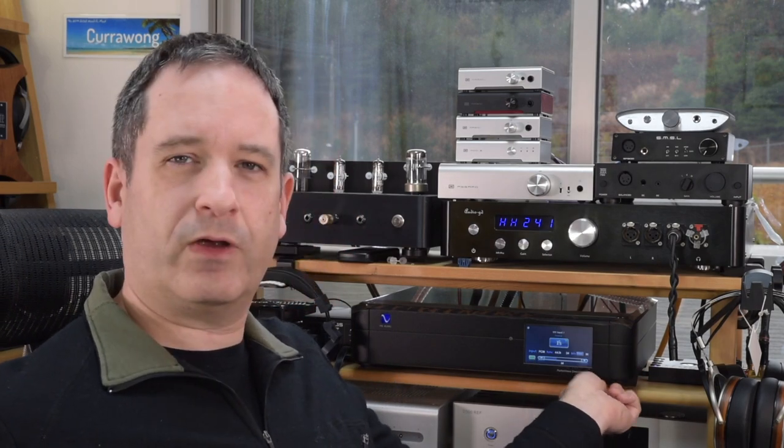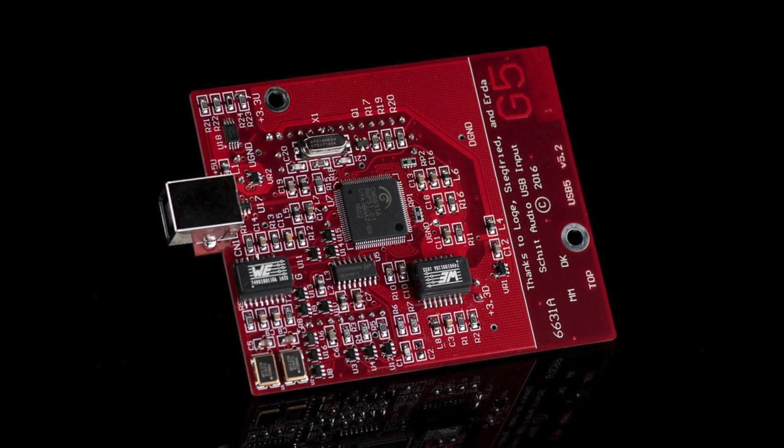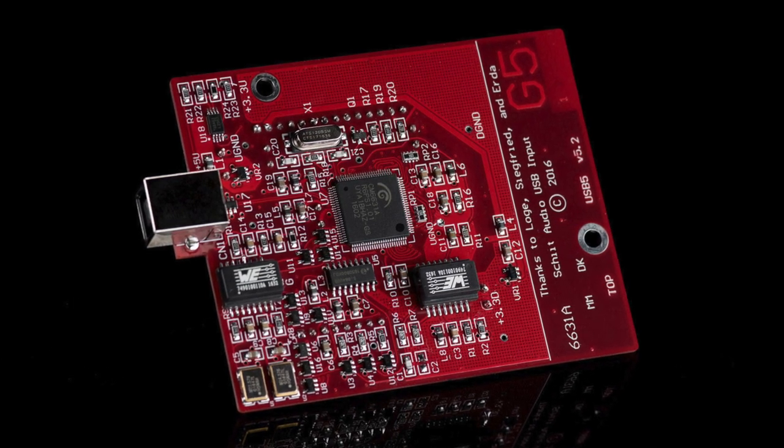I hooked it up using SoundAware's D300 Reference, primarily using I2S, but I did also try the USB. I didn't try the connections too much because of my impressions of the sound. This is a $3,000 upgrade over the USB input. Networking audio is a big thing these days — network connections themselves are isolated. We saw that Schiit Audio took the idea of isolation used in networking audio and used network isolators on their Generation 5 USB to improve the input and block noise. Similarly, network audio can block noise and allows creation of dedicated streamers such as this D300 Reference, completely isolating any issues with the transport and building a dedicated high-quality output. My experience with some DACs means that can make a very useful improvement over plugging directly into a computer.